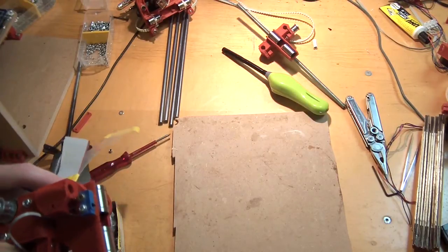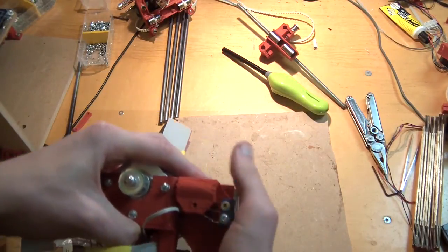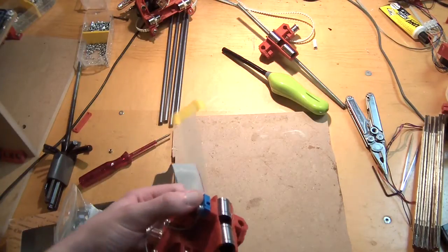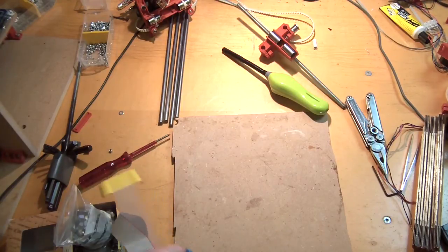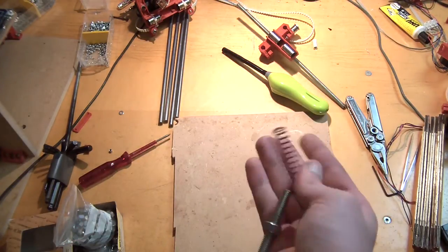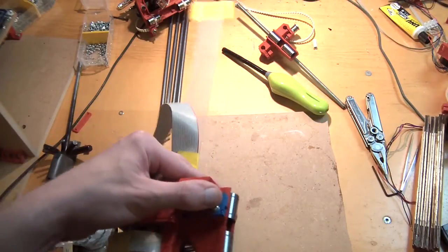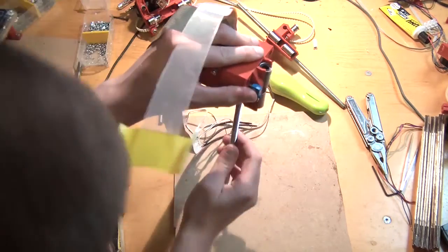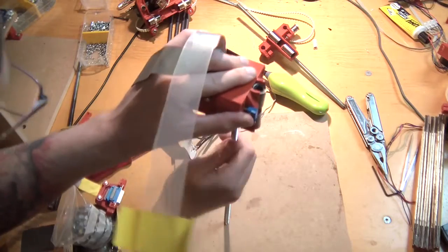This is the difficult part again — you need a lot of force. Sometimes the spring gets jammed and you just have to pull it out again; sometimes it helps to rotate the spring around. It is definitely possible — just need a lot of patience and quite some force. The springs are there so there is no backlash on the Z-axis — basically it keeps the top nut so that it cannot rotate. Otherwise when you lower your machine it would take about one tenth of a millimeter until it starts going up again, and you don't want that. So when it's flush to the top side, screw it in until it catches the bottom nut.